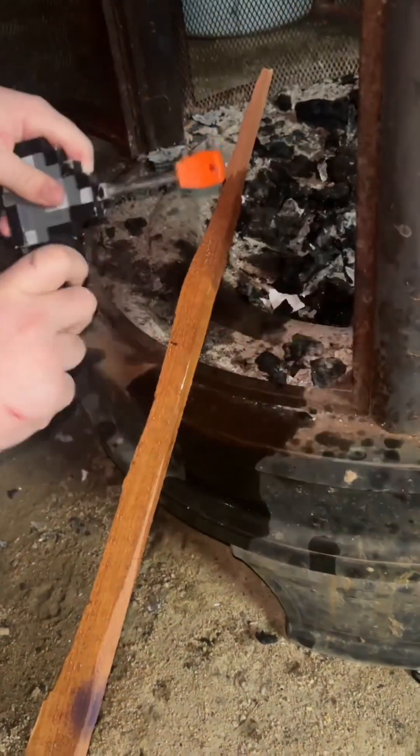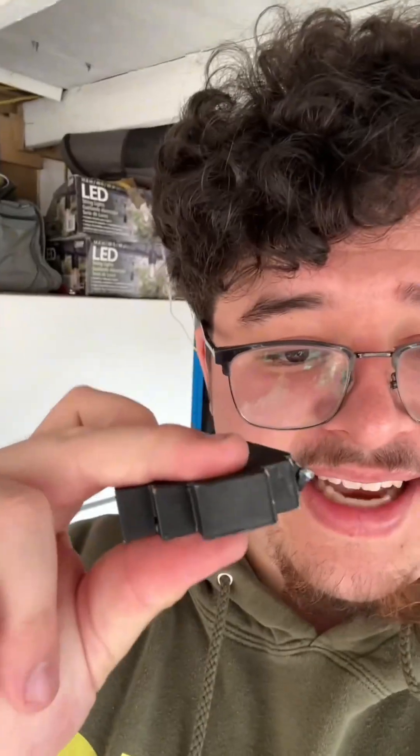Which leads me to the main design flaw. Since I thought the flint would be the one getting shaved, I had PCBWay metal 3D print me this tool steel edge, really small. So every time I smack it together, a little piece of steel is actually coming off of this, and it's small, so there's not a lot of tool steel to be removed. In hindsight, I would have made this part way bigger, but it still creates sparks.